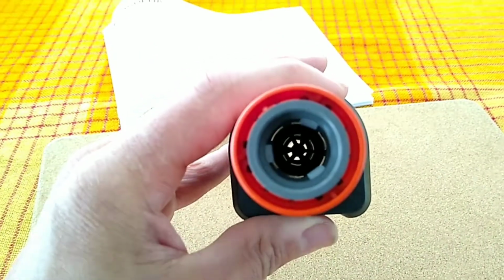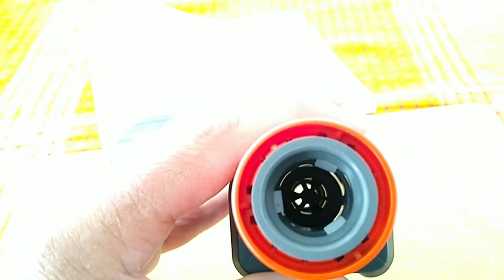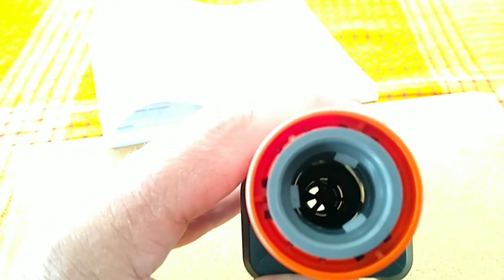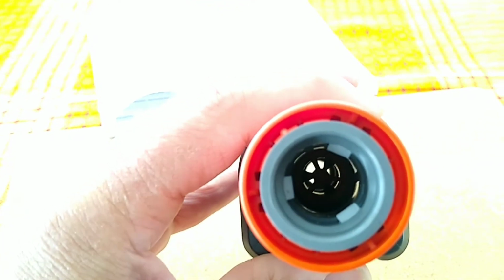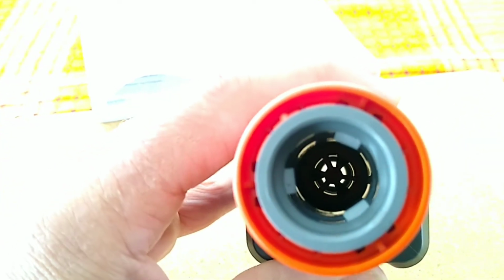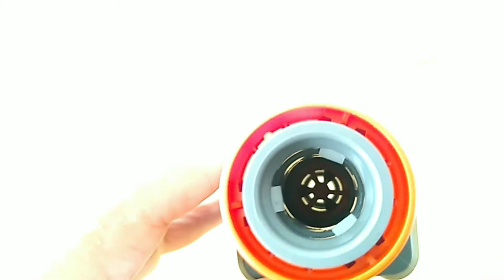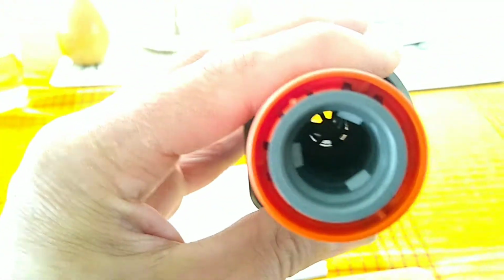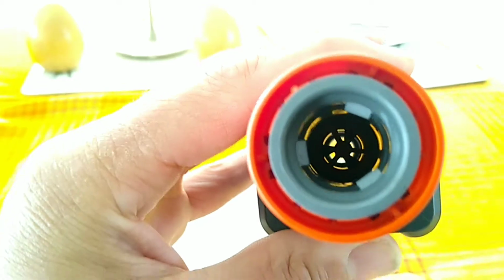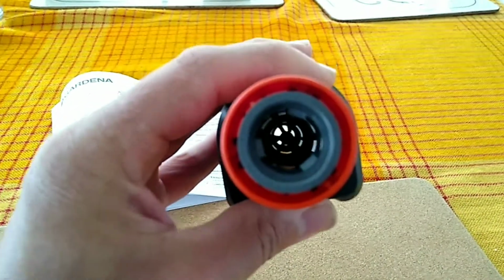Now, given that it's an impeller meter, I would suspect that it probably is more accurate at low flows in some orientations than others. With a standard water meter, they will often specify that it's only calibrated for use either horizontally or vertically. So we'll put it in the different orientations and see how well it registers low flow rates. I would suspect it might work better vertically than horizontally. You can imagine if it's horizontal, the water might just trickle through the bottom of that without turning the impeller, whereas if it's vertical and the water's randomly dropping through it, it's more likely to operate the impeller.